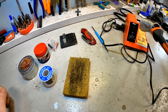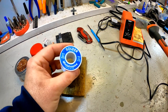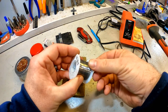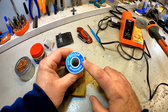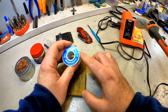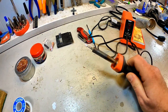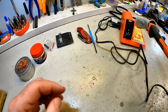As promised, here at the end of the video are the tools of the trade I was using. First up, the solder itself — high rosin core, leaded solder, available in different diameters. This is 0.03 inch diameter, which is actually pretty small; for general RC use you can get away with something thicker. I use leaded instead of unleaded because it has a lower melting point and makes life so much easier — unleaded has a much higher melting point and is just a whole lot harder. I have a sponge — just a typical cheap kitchen sponge — to keep my tip nice and clean. A clean tip is very, very important; it needs to be shiny and super clean, otherwise it does not transfer heat appropriately.